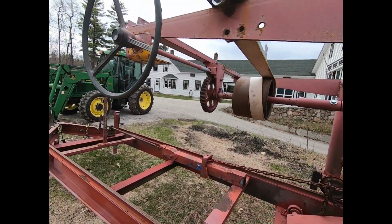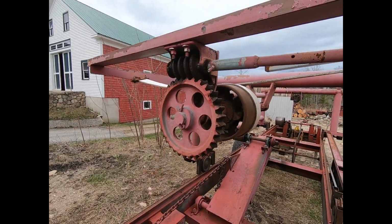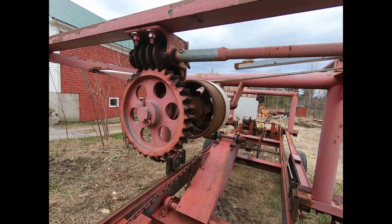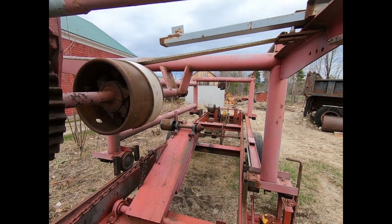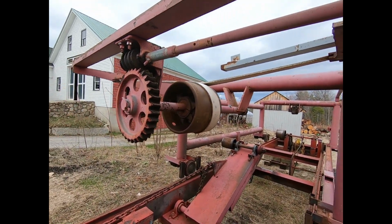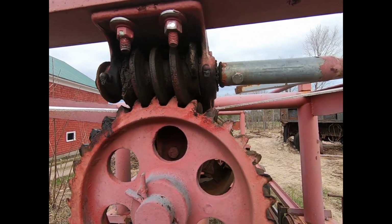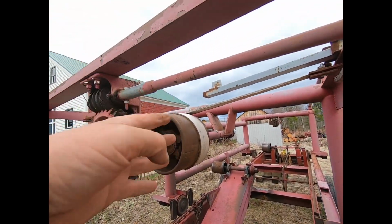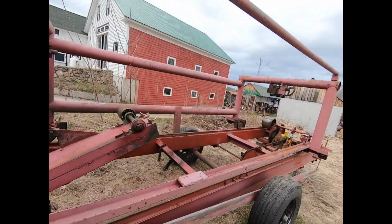And I had this old winch that I picked up at the transfer station that somebody threw away. That's what I rotate the log and do my cutting with. Real simple procedure. The belt just helps hold tension so that while it's in the cut, as you can see, there's a little bit of slop there. If you don't have something to hold tension while you're in the cut, it'll actually kind of run a tapered clapboard, which doesn't do any good.